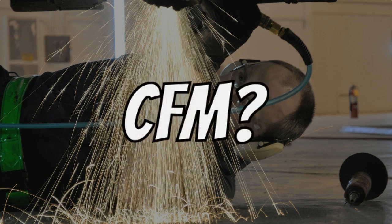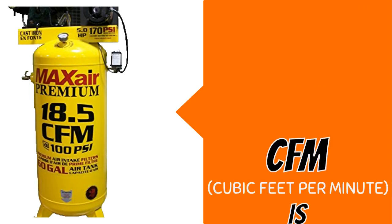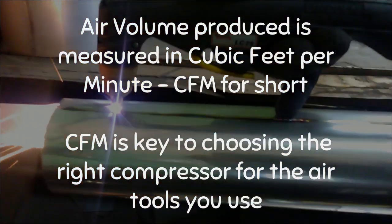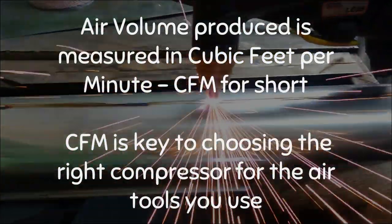CFM. What's the maximum air volume required? This is also known as CFM. Here's a hint, look at your air tools. When it comes to compressors, CFM is king. Air volume produced is measured in cubic feet per minute, CFM for short. Now CFM is key to choosing the right compressor for the air tools you use.